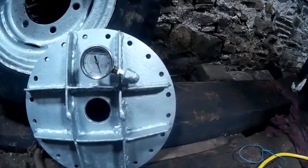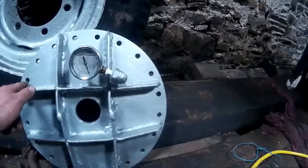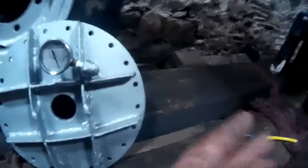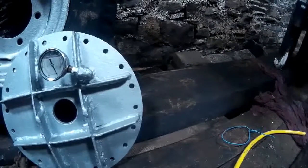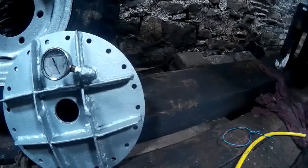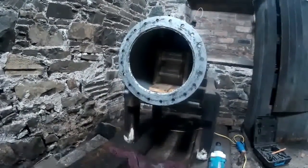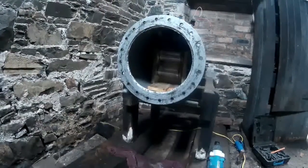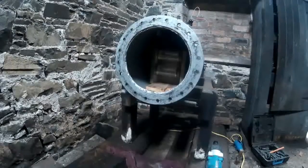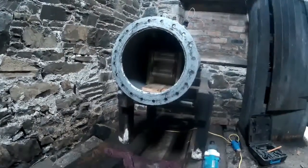But high hopes. Probably without that flex, the O-ring is going to stay in contact and these bolts aren't going to be stressed by a kind of bending moment as the front plate bends. And we should be good at up to 40 bar. That's the hope. We might even get an improvement if these end caps hold out. I'm not sure. There might be issues with the end caps. There might be capillary action down the fibres of the GRP. All the fibres were exposed, so I'm not sure about that.